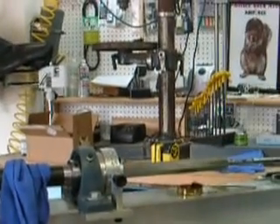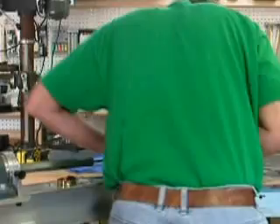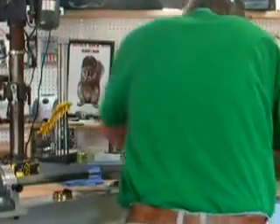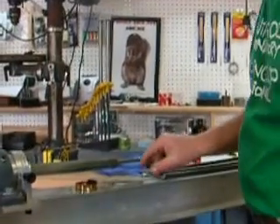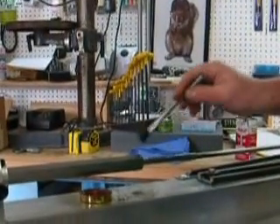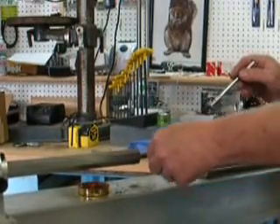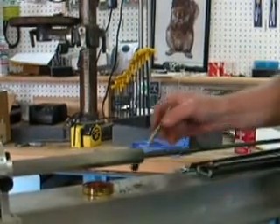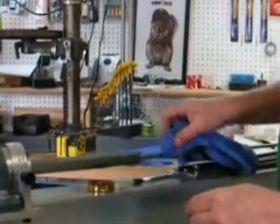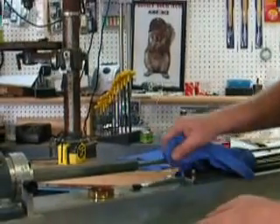So I'm going to groove number five. And there's a bunch of cuttings again. Now, since I raised it about one and a half ten-thousandths of an inch per pass, and I need three and a half thousandths of groove depth, I have about twenty passes times twelve grooves — so obviously this takes a little while to do.